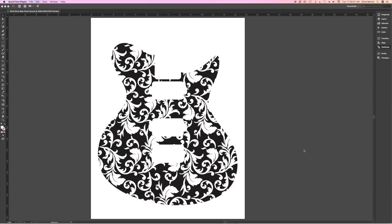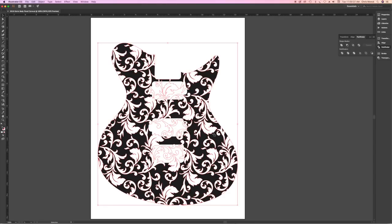The first step in the process is I need to create my design. I'm going to draw up the plan in full scale in Adobe Illustrator. You can use any kind of vector-based drawing program as long as it will save out a format that you can use in your CAM process. Everything that is white is going to be raised up and everything that is black is going to be recessed into the wood. Once I'm satisfied with the design, I'll save it out as an SVG file.